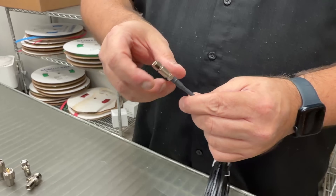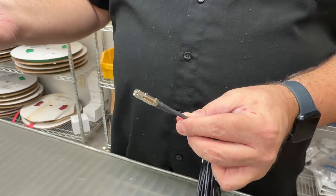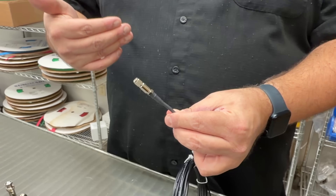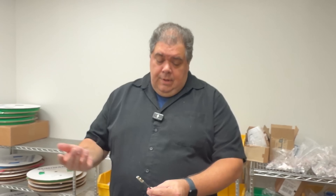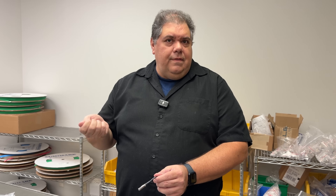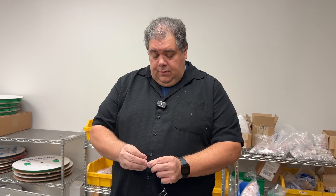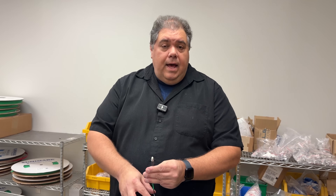These FMEs are available in something as small as the 100 series, but we also do it on the 195, which is a 58 size, the 240, which is the 8X size, and we even have them for the 400 size. So if you're a new ham routing a cable through the house, you can buy an assembly with an FME and route the cable through, because that connector set is smaller than the PL259 — it's the same diameter as an 8X size, so it's a quarter inch. Now you can filter this right through the house, get set up with your shack, and reconnect it.